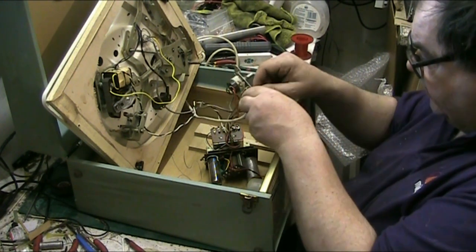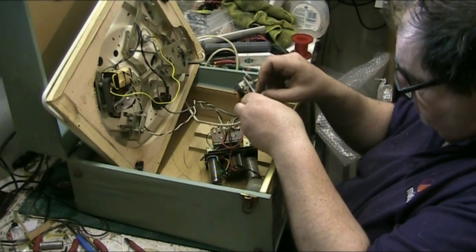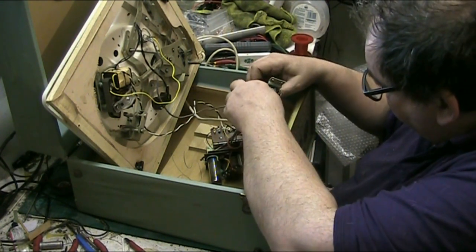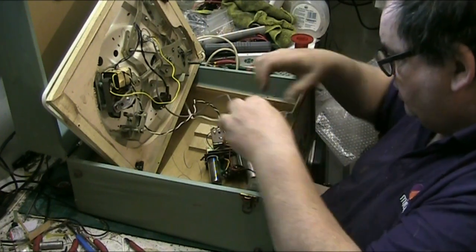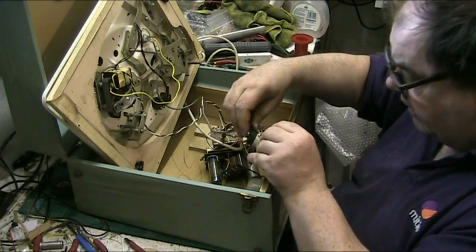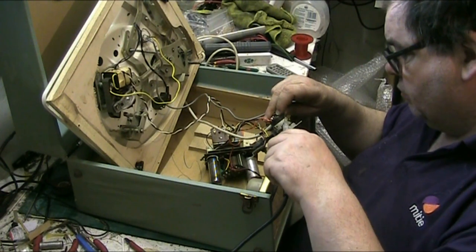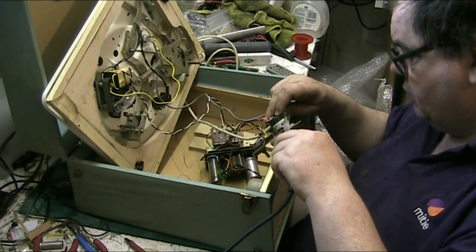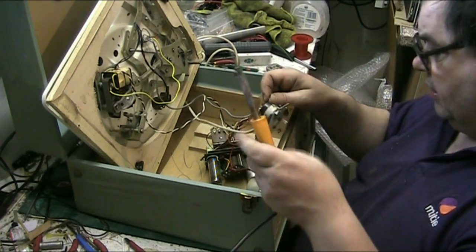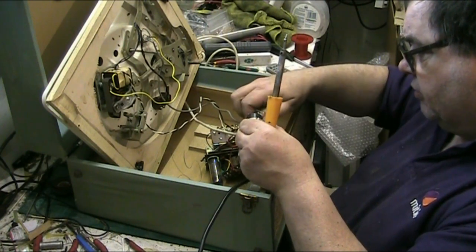I mean, they didn't put the rectifiers very tight on in these. No. Because we need this top one out anyway, so we can get the... Now we can take the wire. Now we can unwire the switch, the power cable. See, they just earthed the power cable to the volume control pot, which would never pass regulations today, but that's how it's going back on, because that's how it was done, and it's been alright all these years, so I see no reason to not put it back the way it originally was.